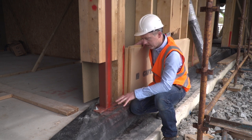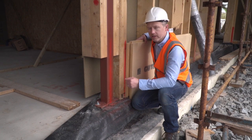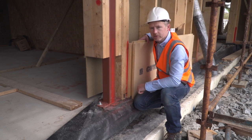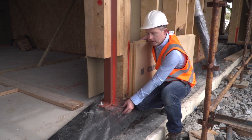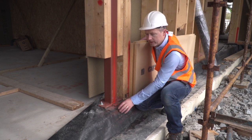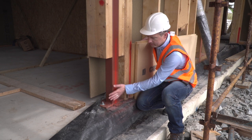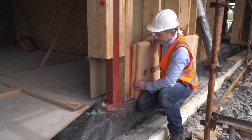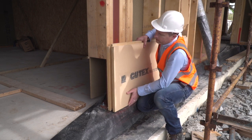On the foundation of our house here, we're using a core passive foundation system, so the whole foundation is a raft of insulation onto which the concrete is poured. On the outside of this whole panel here, beneath this damp proof membrane, the core insulation wraps right up. This is thermally broken from below, but on the outside it could be a major thermal bridge, so this is where the Gutex has a key role to play in isolating thermal bridging.